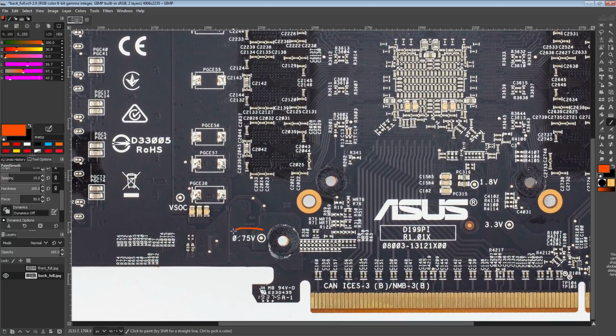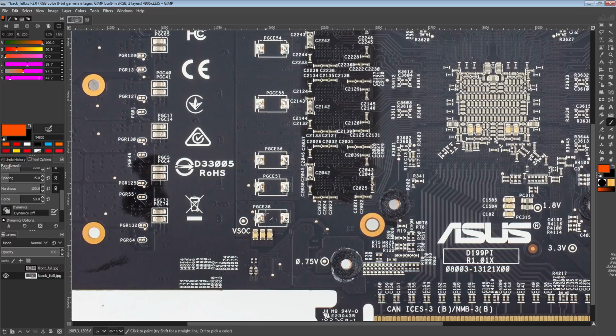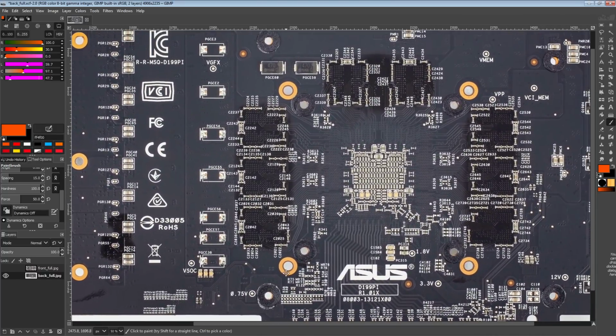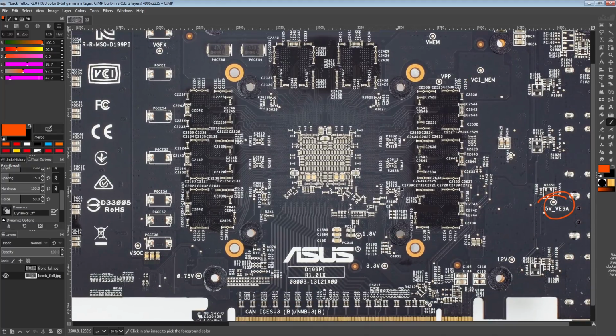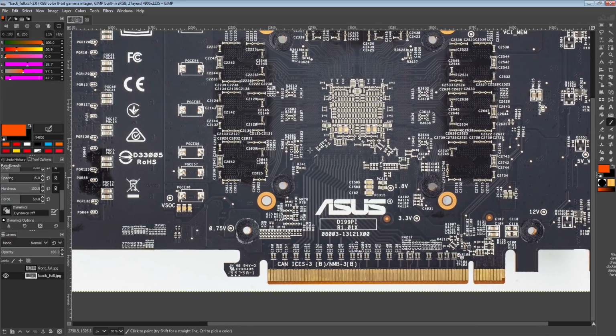So it's just cool to see it labeled SoC rail. The AMD GPUs have been steadily getting more and more voltages. It's actually kind of ridiculous. It used to be that you had vCore, VDDCI, VMEM, and then minor rails: 1.8 volts, 0.95 volts, that kind of thing. And now you also have SoC and VPP and all of that. So VMEM is labeled, memory controller is labeled. The 5-volt VESA always existed, but whatever.